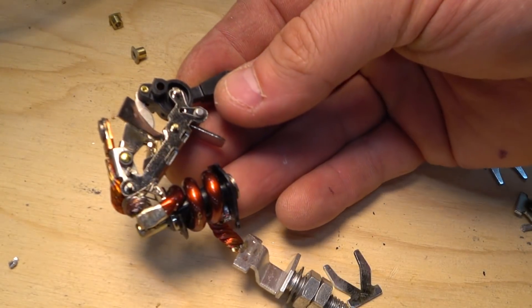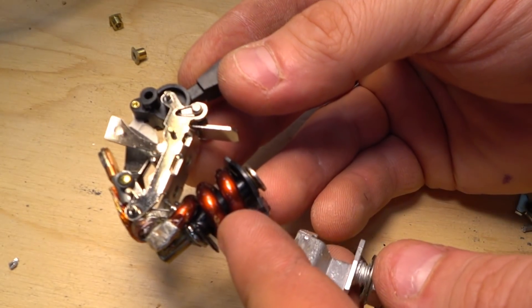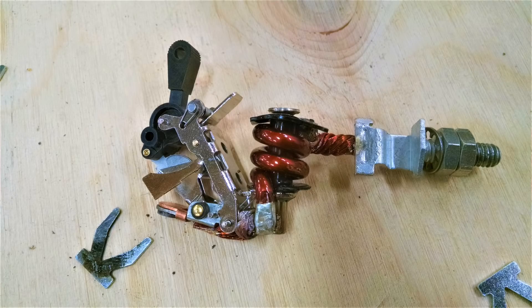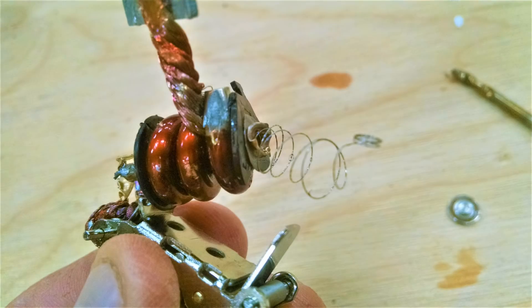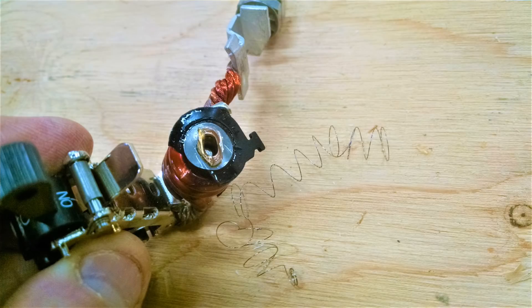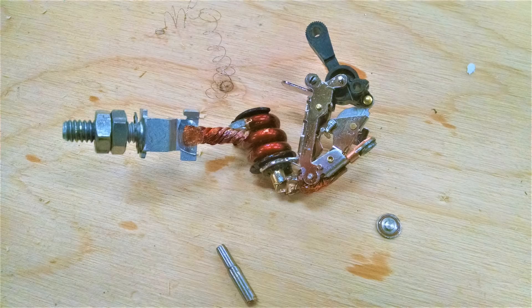There you go guys. I don't know if there's a thermal brake to this or not — I think this is an electromagnet just to pull this contactor down. I kind of pried everything apart. Sorry, I ran out of juice in my video camera, so here are some still shots. I kept playing with it and snipped off the bottom. It turns out this is a brass sleeve with oil in it, and it also has a ferrous steel rod stuck to a magnet. When I snipped the top I was able to pull out a spring, so it looks like the spring would keep that ferrous rod pushed down away from the spring-loaded switch unless it was energized, and that would pull it up — so maybe that has something to do with the thermal delay.